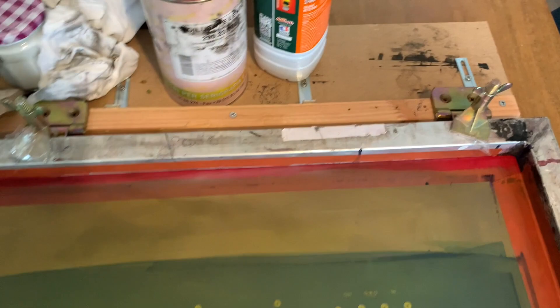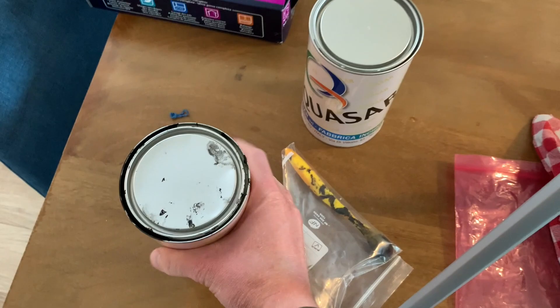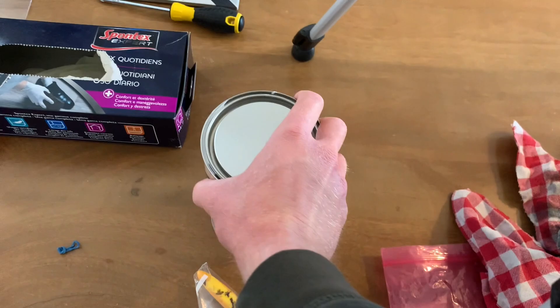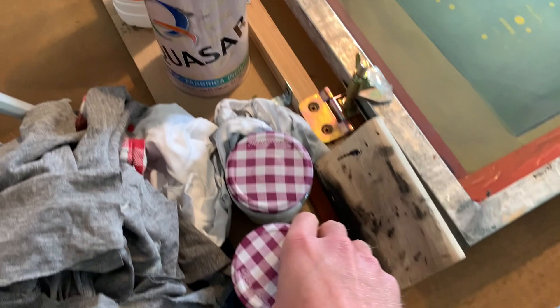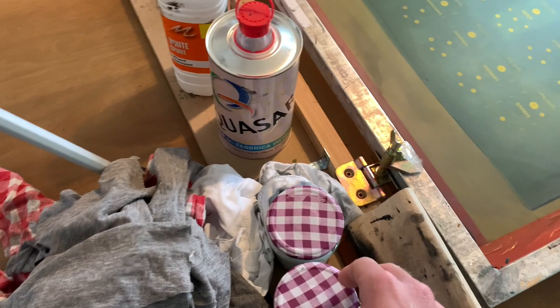You've got to get these hinges so that you can lift the screen up and move it, and the jig for everything to sit on. I chose a solvent-based ink because it's really durable — it melts into the polyurethane of the enclosure and doesn't require a top coat after. Here's the white, and you'll need a dilutant. Mine has to be diluted down five to ten percent, so I put a little ink in jam jars and dilute it down by weight, mix it up, and then it's ready to go.